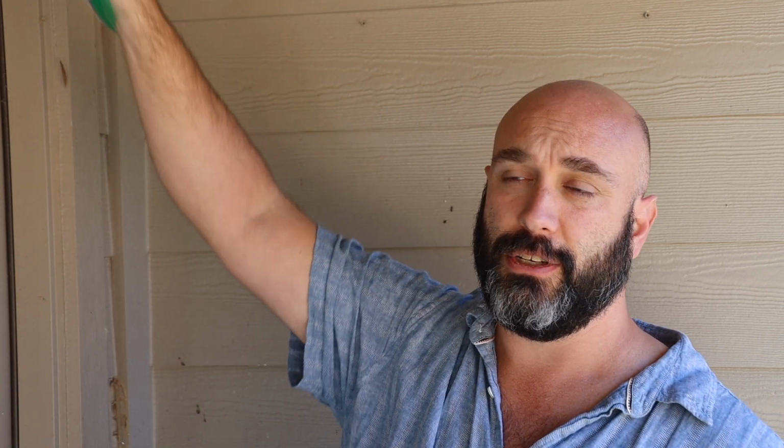Alright, as soon as we get that new Starlink Ethernet cable set up, we're going to run that Ethernet cable out here and then find a spot for our new antenna. I'm going to push this cable into that new split plate that we just put in. It's going to go through attic space with some insulation, so I don't have any Ethernet covers handy. I don't know where they are. So we're going to use a little Ziploc bag and some Scotch tape and then push this into the attic space through the insulation, and it's going to go through an interior wall where we already have a plate from our last video. Go check that one out where we did the shop Wi-Fi. And then it's going to go to the modem for Starlink. So we'll be able to test this and make sure that, hey, it's working. For now, we can get it set up and we can start speed testing.